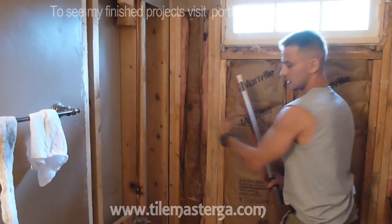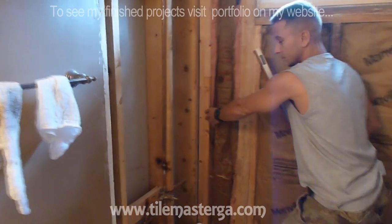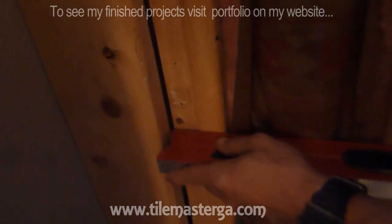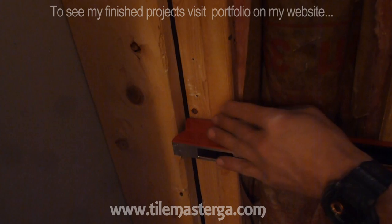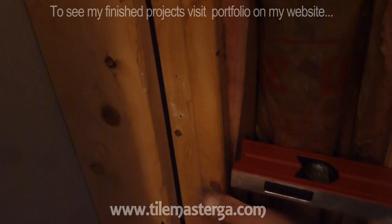In cases like here, in this corner, you can look over here, this stud, the original framing, was actually pushed back more than a quarter of an inch, almost half an inch to the corner, causing the entire corner of the wall to be crooked. So what I did, I nailed a sister stud on the side, and this is where I'm going to put the screws and attach the board.